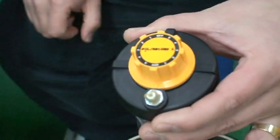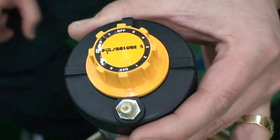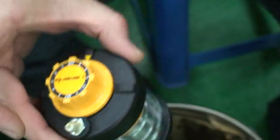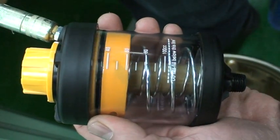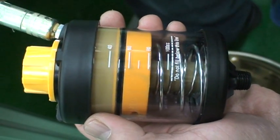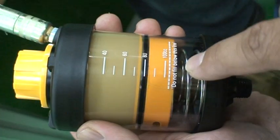We then place the position to off and then put the lubricator. Clean out the tip. Put the lubricator on the tip of the grease valve and fill.